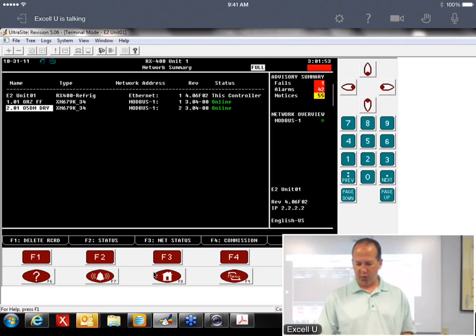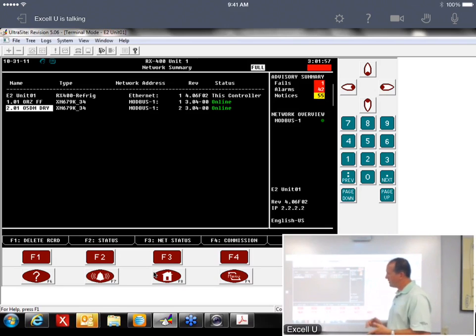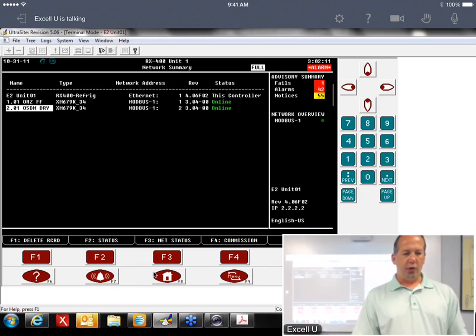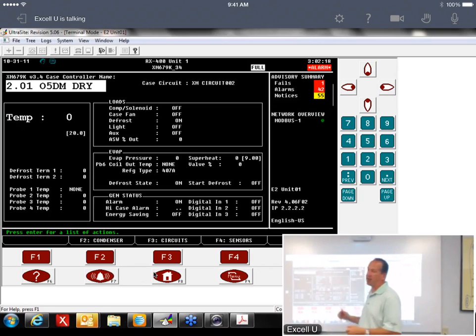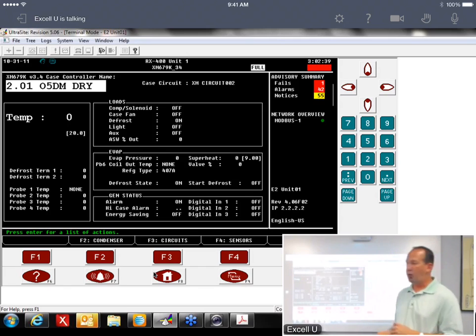If we've got a few more minutes here, I'll go over a couple other things too. There's been a handful of times, and mostly it's with the legacy E2 controllers. I think the networks are a little bit slower. When you first bring some of these online, whenever you force the parameters down and you're watching this, you want to make sure everything populates. What I've seen is sometimes maybe PB2 or PB6 doesn't show up, so it won't read superheat. What it is, is that parameter for the temperature set or for the type of probe just didn't get loaded down in. It didn't get pushed, so it won't read that particular device.